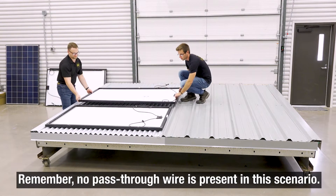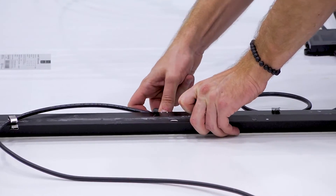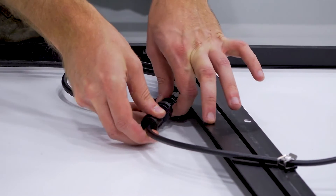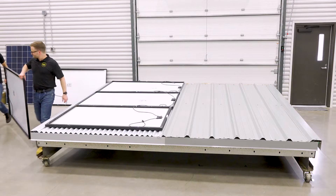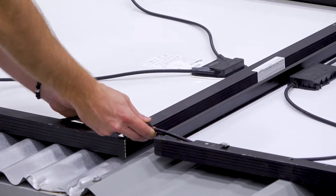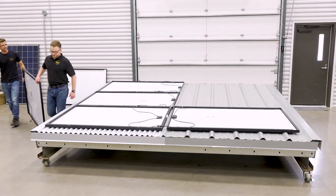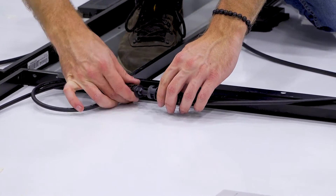As you can see in this scenario, there is no pass-through. You're just connecting the modules together, which is very simple, especially if they're right next to each other as you install the module. As this one is being installed, this is where the connection happens — it completes the string as you go upward because these two are now connected electrically. It was easy to do since the plugs were ready to go, prepped at that exact location. As they do the last two, it's installed as before. There's no pull-through in this case, so the end result is a very simple string.